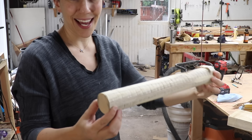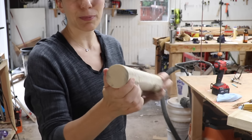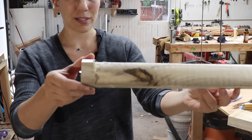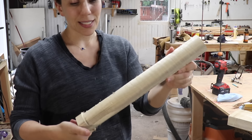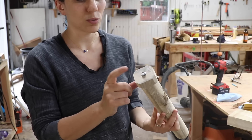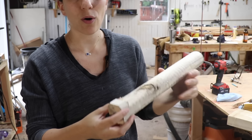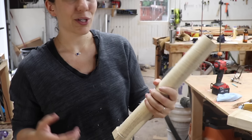That totally worked — I have a two-inch dowel! It needs a little bit of cleanup work and maybe some adjustments to the jig, but overall the idea works. This piece was actually slightly thinner than two inches when I started, so there are two flat spots, but this was just a scrap piece of ash to test on. It just needs a little sanding and tweaking of the jig. I also want to figure out a different way to mount it because this wastes a lot of wood and didn't feel very secure, but super cool.